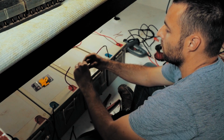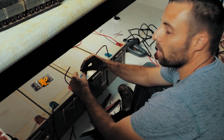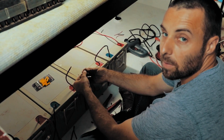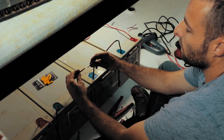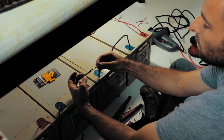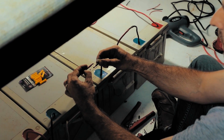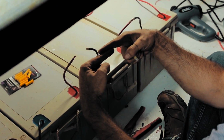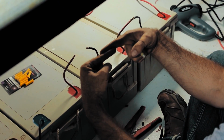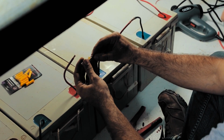One thing I learned about soldering when I did the first solar episode, and this is something Richard told me and I forgot when he came over last time: when you join your wires, rather than twist them, you want to leave them straight, untwisted, and then you mesh them together so that they become like a mechanical join, if that makes sense. And then the solder is simply to stop them from coming apart. If you twist them together and sit them like I did last time, they don't get as good a join, and theoretically you can create a heat spot.